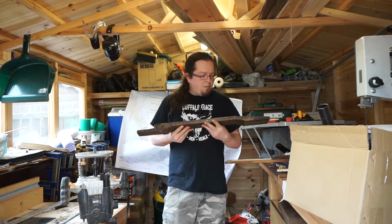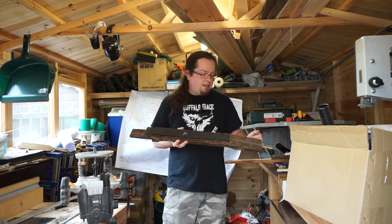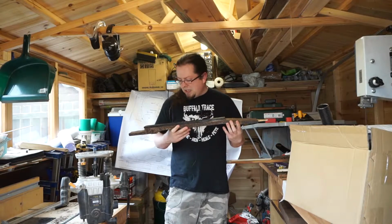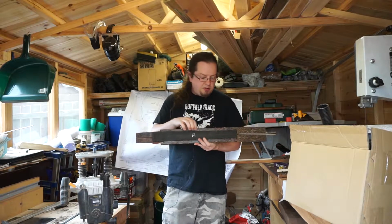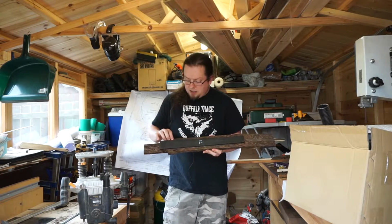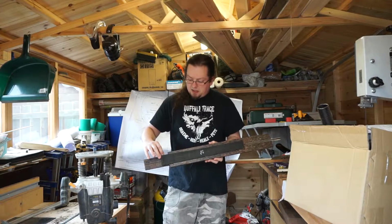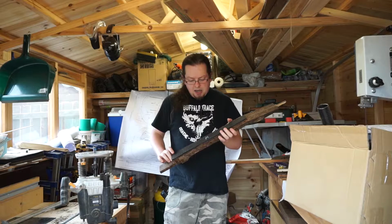Now, most of the time when I've seen people do this, I've usually seen them plane down the neck, but in that instance, they tend not to have a one-piece headstock. They tend to use wings. My plan is to use the fretboard, which has already been tapered, as a kind of routing template. So the idea is just to run the template router cutter along the edge of the fretboard, and that should take off the neck to the right thickness.